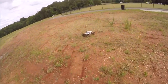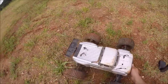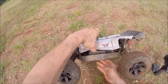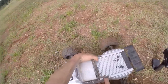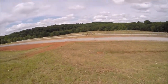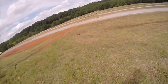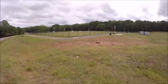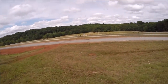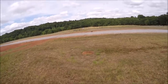She landed sideways. I'm having an issue with my ESC connector — no matter what I do, even spreading the little tongs out, it keeps coming unplugged. I'll have to solder on a new connector.